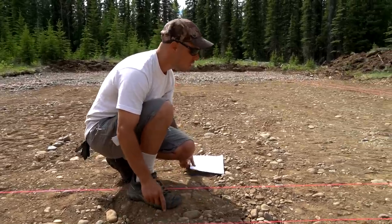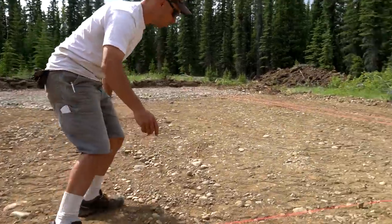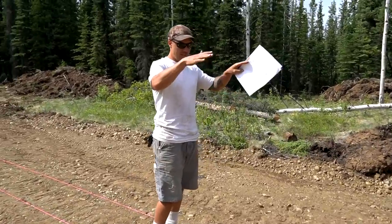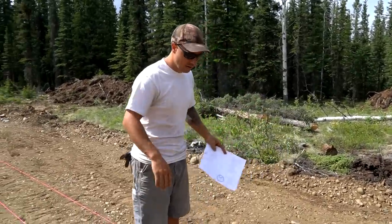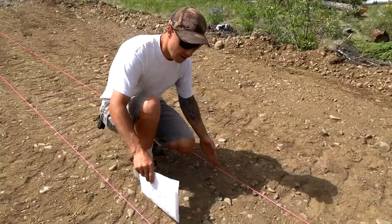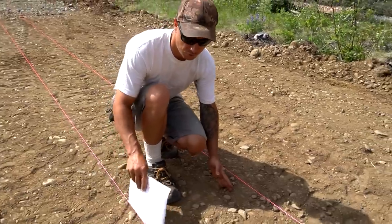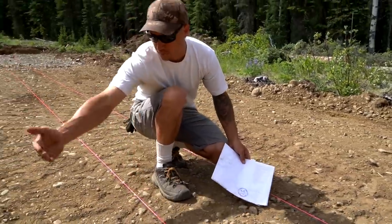That's going to give us an 18-inch footer. The footer on this side is going to be a little bit different. Quonset huts are pretty unique, where they almost have a lot of outward pressure going down on them. So this footer, we have it marked at 22 inches. That's 2 inches of foam, and it's going to be a 20-inch footer. And then this one's actually going to angle up into the slab.